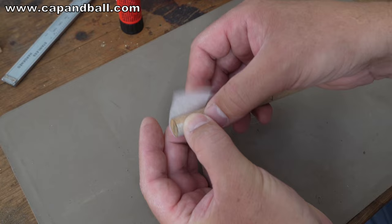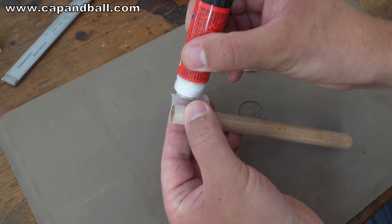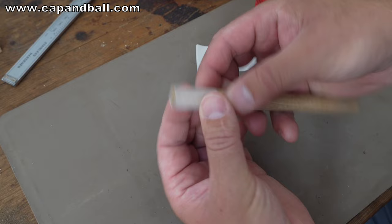Making the combustible envelope cartridge is quite easy. The paper I'm using is hair curling paper, but to be honest, any thin paper will work. You won't have to nitrate the paper. It will burn properly if it is thin enough. I fired 40 shots and there was no need to clean the chamber from powder residue.